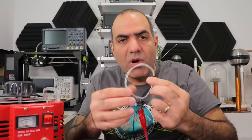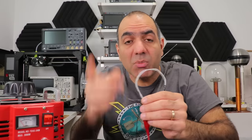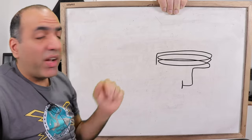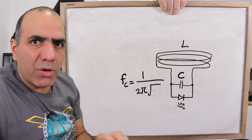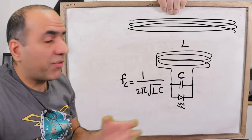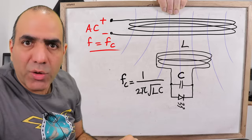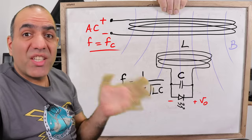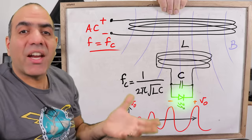You know, if someone drops you on the sun, closing your eyelids won't save your eyes. Such small inductors need to run at much higher frequency, like 100 kilohertz or more. Let me explain the plan: my fireflies have an inductor and capacitor that resonate at a specific frequency, excited by the fields from some bigger transmitter coil running at the same resonance frequency. So the voltage across the resonance circuit rises to a point that can turn on an LED across it.